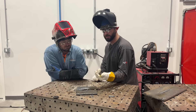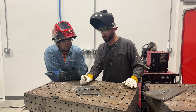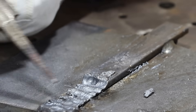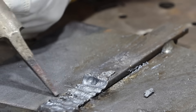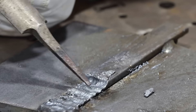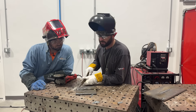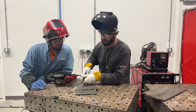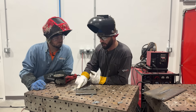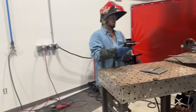You can see we made a mess — this is that soup I'm talking about. If you don't get enough air, especially with the amount of metal we're trying to remove, you're going to get a lot of it. You've got to be really conscientious of the distance to that electrode. You can see this backing strap — this is the closest point I'm getting to hitting that base metal. You can always take off more; you can't put it back. Clean it as you go, get a bunch off, clean it up, and then see where you're at.